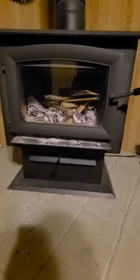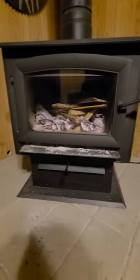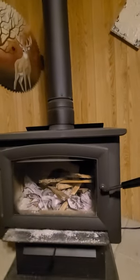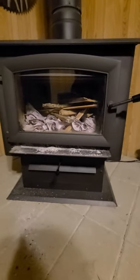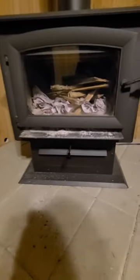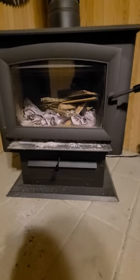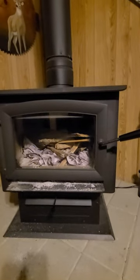It's been a good stove, I really like it. I almost think it could maybe have a little bit bigger burn chamber, but it works very well. Our house is about 1,300 square feet, so it's not very big. It's supposed to be rated for like 2,000 square feet — I think it's like 115,000 BTU. No damper; it's supposed to all be controlled by the air lever on the bottom. It's got an ash pan on it — I personally never used it. I have an ash vac from when I had a pellet stove, so that's what I use. I just vacuum it up real quick.